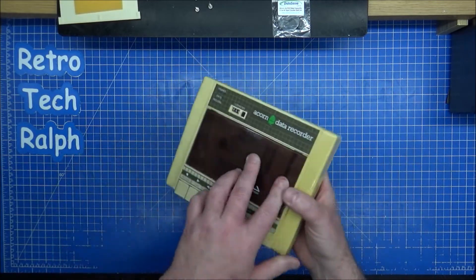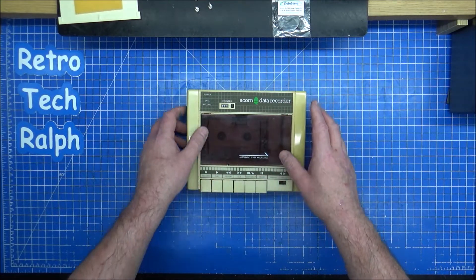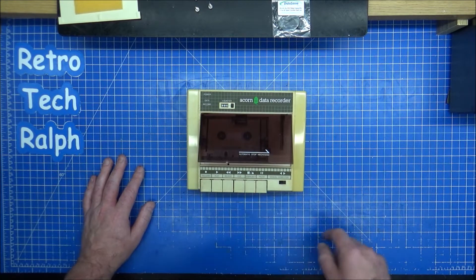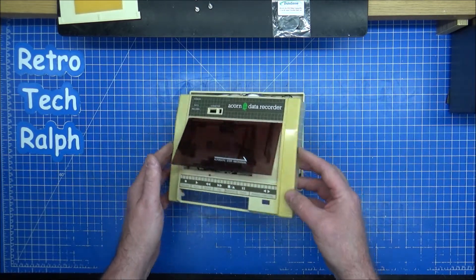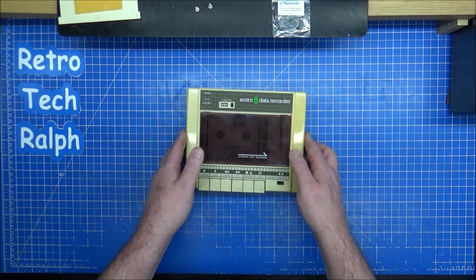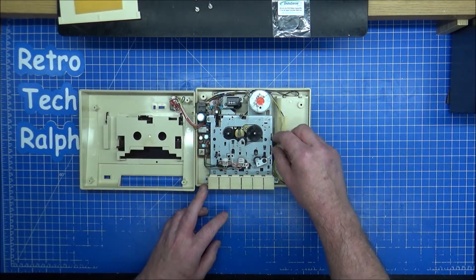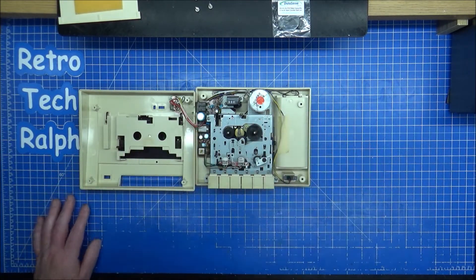Screws are out. Now turn it round. Here's where you need to be careful — when this works perfectly and the bit of plastic has not broken off inside, press the stop-eject button because that piece of plastic on here will be wrapped underneath the mechanism and the lid will not come off like that. Let me show you properly — that's down, it will not just come off because the lid is down. I'll refer to Retro Box Room's video in the description. That is not the piece of plastic that breaks off — there's somewhere else that breaks off. Watch that video, it's really good.